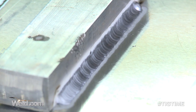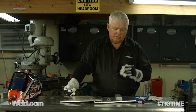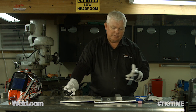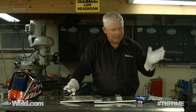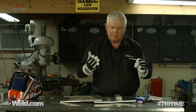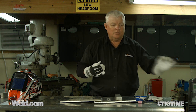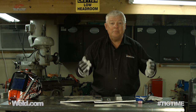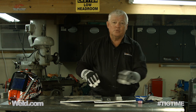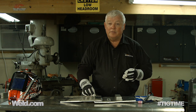Overall, the welds — and you can judge the welds — we're going to come down here and do some close ups for you. It cleaned, it got the oxides off. You could see the cleaning activity taking place, and anyway this passes my test for the heavy aluminum. I did notice that in arc initiation there's just a little bit of roughness to it. It's not enough to disqualify the machine — in fact the roughness may be associated with my own setup. So I'm not going to disqualify it, and this certainly has Mr. TIG's approval for these tests.